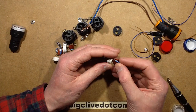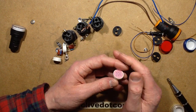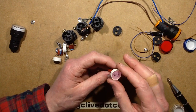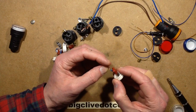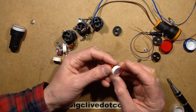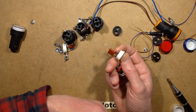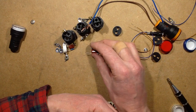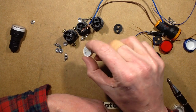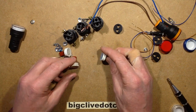I would guess that hopefully, if they're just using standard capacitors, the ones designed for 110 volts, and they do these in 12, 24 volt, 36 volt, I think, 48 volt, 110 volt. I'd guess up to about 48 volts they may be using resistors, but from 110 volts, if they use the same capacitors, then they would be okay for a 110 volt supply. It's just the 400 volt one and the 220 volt indicator was fine. But the ones where they've just really cheaped out for the much higher supply voltage, that's not fine. Recoverable, but as I said before, it's not a particularly ideal situation.